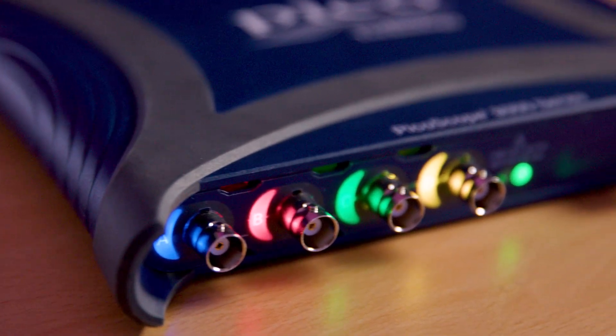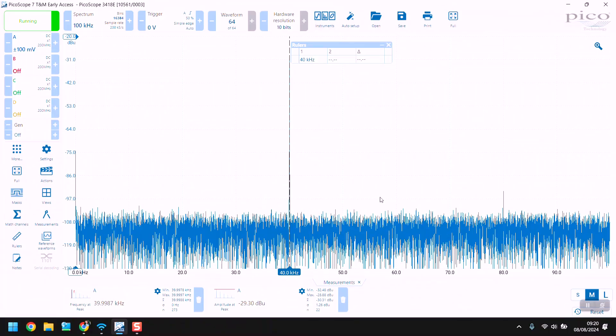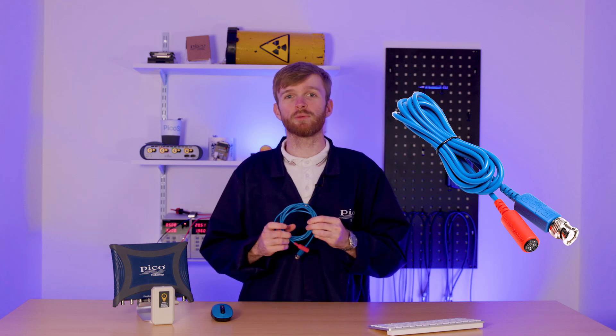For the data acquisition we've got a PicoScope 3418E, a four-channel 500 megahertz oscilloscope. This will collect the data and allow us to measure the peak power received off the ultrasonic 40 kilohertz sensor. We can use the TA329 ultrasonic sensor to measure the received ultrasonic waves with the BNC interface, plug it straight into the scope, and scan along potential leaky areas in the room like a dog sniffing in an airport.